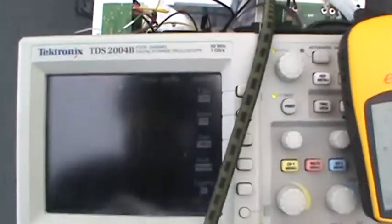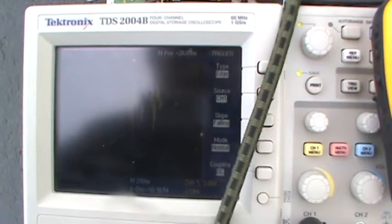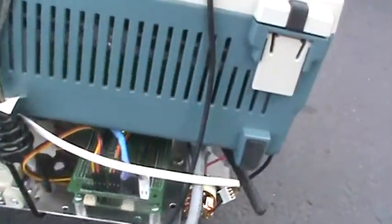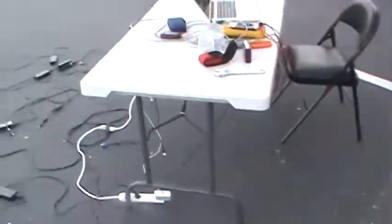Perhaps one thing I can do — what I have here is the oscilloscope set to trigger at any 2V divergence from the 5V rail. Since the compass is not working, you can see there's a red LED blinking on the microcontroller. I'm going to go to the laptop and just use PlayerJoy to move it forward and backward and see if I can capture some noise on the 5V rail. So first I'm going to start the server — server started. And I'm going to start PlayerJoy. The PlayerJoy has been started.